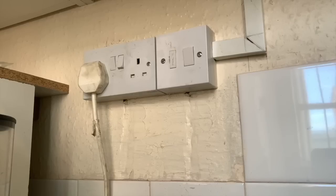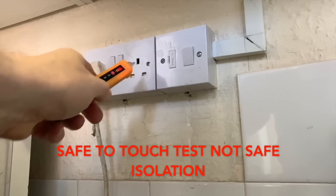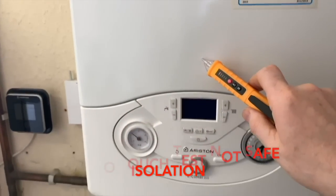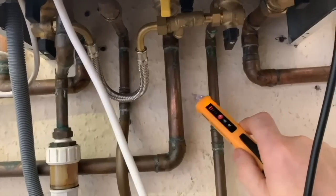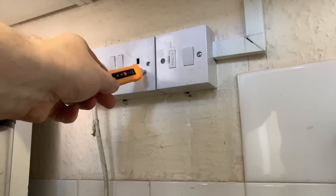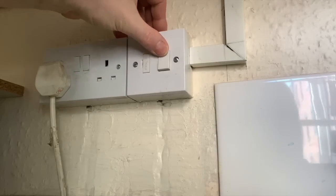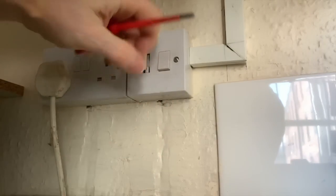Let's look at the water sample test more closely. The first thing to do before touching any gas appliances is use a non-contact voltage indicator to make sure there's no stray current going through the system. Use it on the boiler casing to make sure it's not live, then check all the pipework underneath. Because we've used a non-contact voltage indicator, we need to prove it's still working — prove it, use it, prove it. Then isolate the power supply to the boiler and retain the fuse so nobody accidentally turns the power back on.